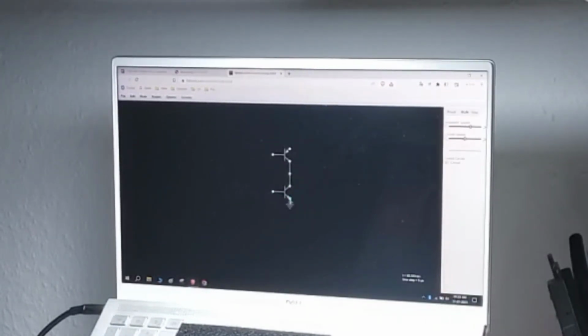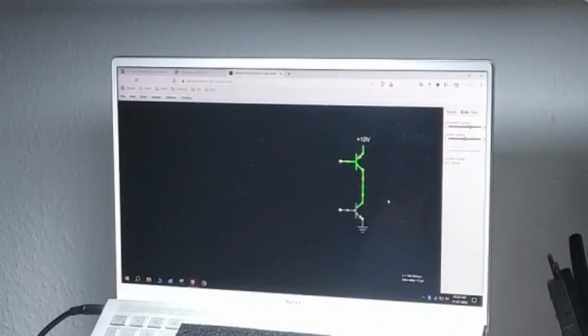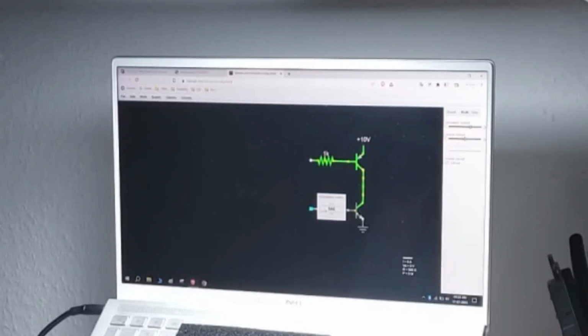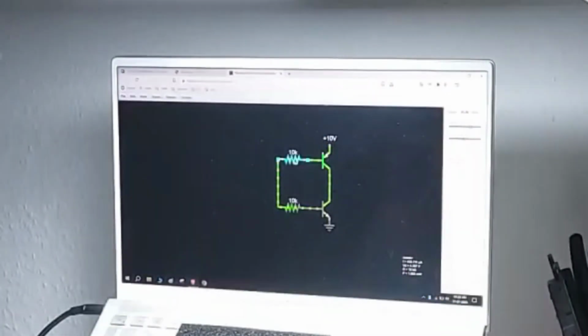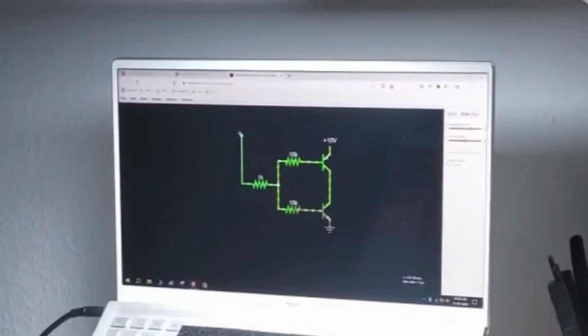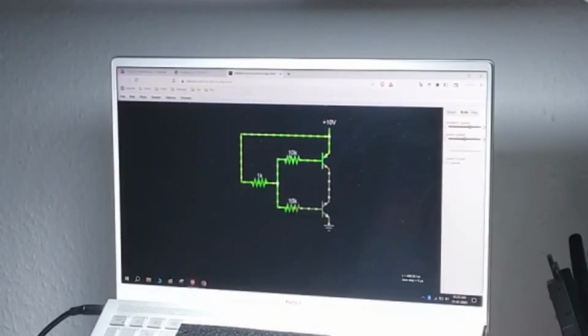If he knew the rule of 10, he wouldn't even have to bother about simulation, because he knows that if the resistor is 10 times smaller, it just overcomes everything else. They literally inject pretty much the same current. That's an order of magnitude less! Anyway, you can do your simulation. As predicted, I made a calculation error, and it's not 4.3 milliamps, it's 430 microamps, but who cares? How many orders of magnitude is that? A few.